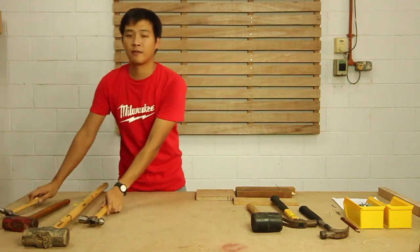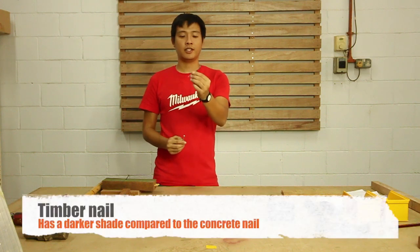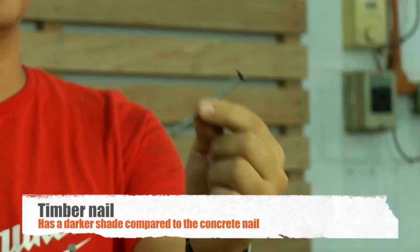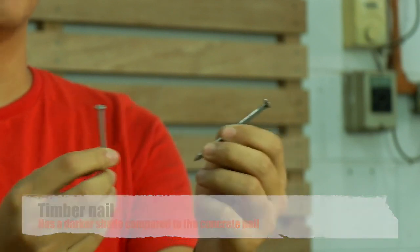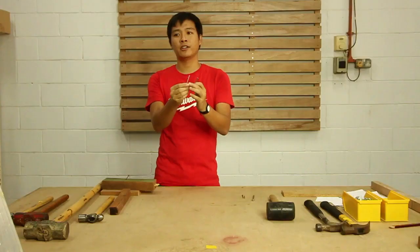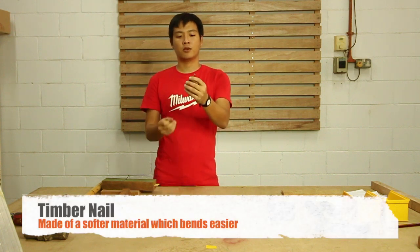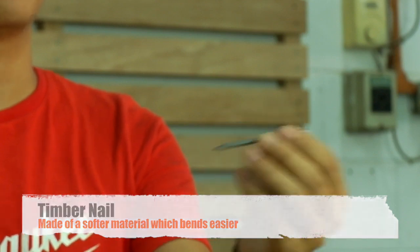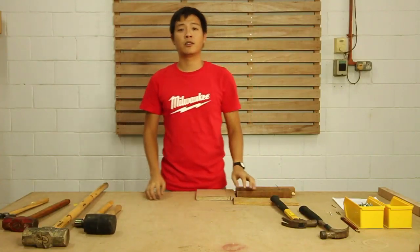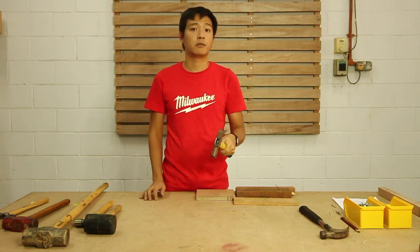So these are the few types of hammer. Here I'm holding two types of nails: this first nail is a timber nail, which is a darker version compared to the concrete nail. The concrete nail is a harder nail which you can sink into concrete without bending. The timber nail is the one that can be easily bent if you use it for concrete. I'll be showing you how to use a claw hammer to sink a nail into the timber.